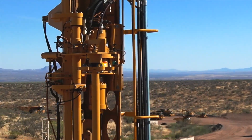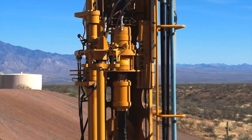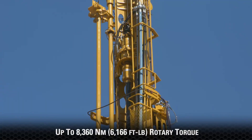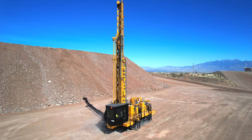A powerhouse feature on this drill rig is its rotary top drive. This is what drives down and rotates the pipe and cutting tools to penetrate and chip rock. The MD6200's rotary top drive can reach up to 6,166 foot-pounds of torque. It's designed to optimize both torque and speed.